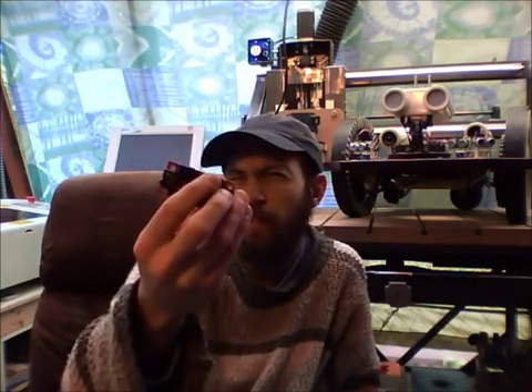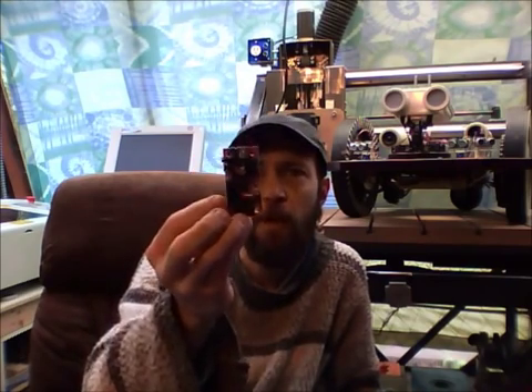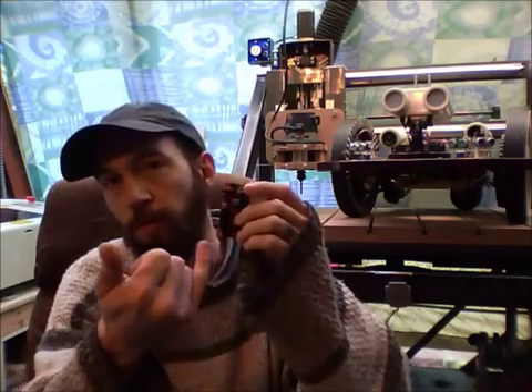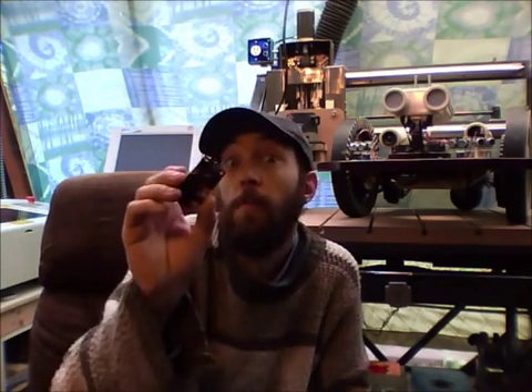You have ISP if you're an ISP person. All of the pins and IOs are broken out to male and female headers, with almost all of them broken out to three-pin power-ground-signal headers as well. Male or female jumper wires, anything you've got, you can plug in — no problem. For your main bank of IOs you have the ability to switch between the 3.3 volt onboard supply and an external supply, which is great for servos or whatever else. I think you can run eight servos with no modification whatsoever.